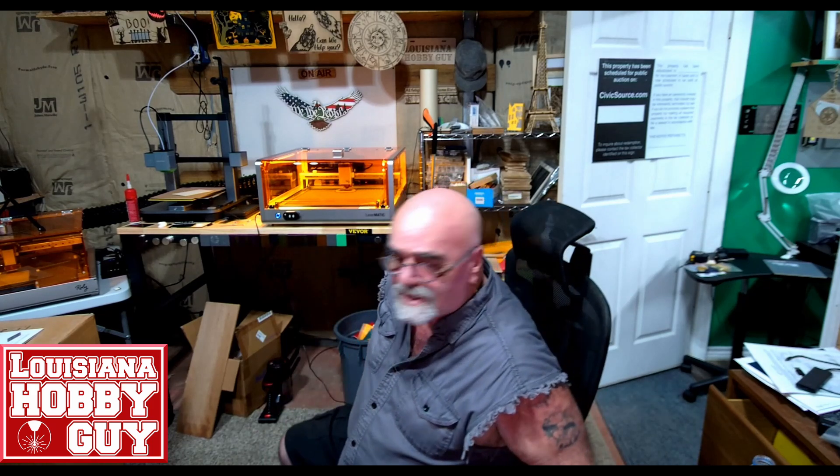I'll put a link up there to the live video if you want to see the dual unboxing we just did. In a second, just for fun, I'm going to get this off the laser — it's just a cork. I'm running the job at 18,000 millimeters per minute with one layer set at 65% power.